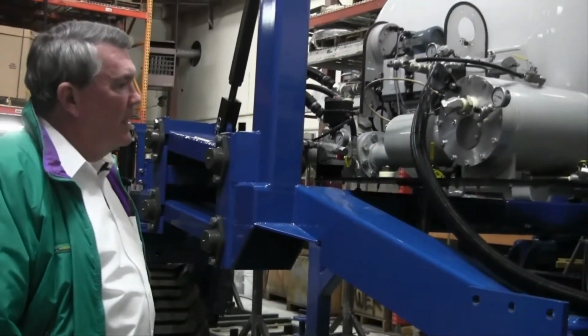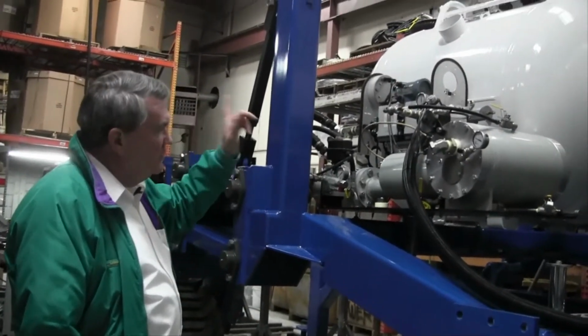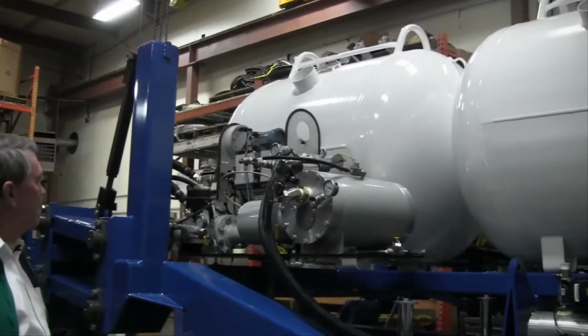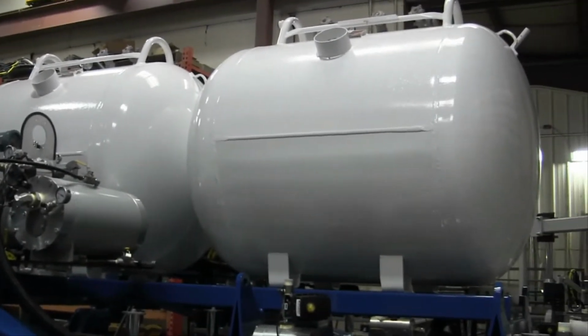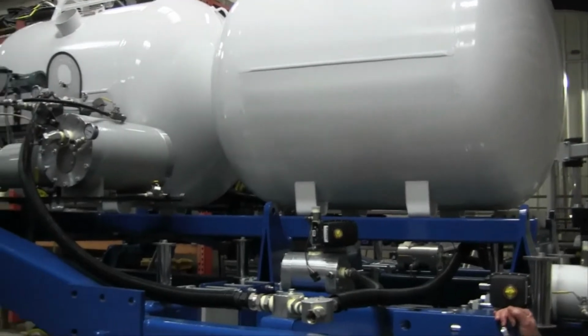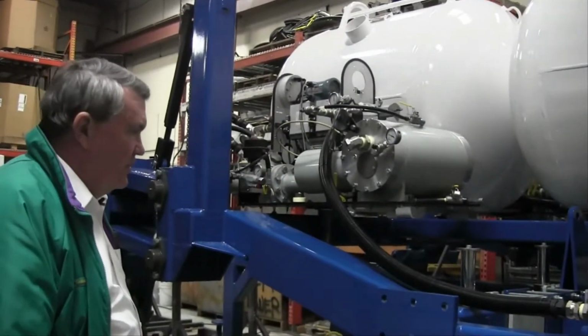Moves in a parallelogram, very heavy parallelogram. 2KC Series 3 Weighmaster for the ammonia. Just getting it put together, and of course on the other side is the liquid system with the sparging reflow, and that particular system will allow us to inject micronutrients also, because this machine will have 2 extra liquid tanks on board for injecting micronutrients.